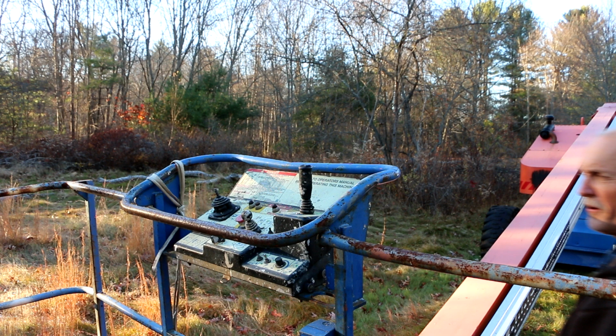So I did scrape off enough of the silicone to get to the bottom two contacts on that capacitor so I could do an in-circuit test on the capacitor. It passed ESR in circuit, so I'm just going to roll with that. I don't think that was currently one of my problems anyways, so we'll see.